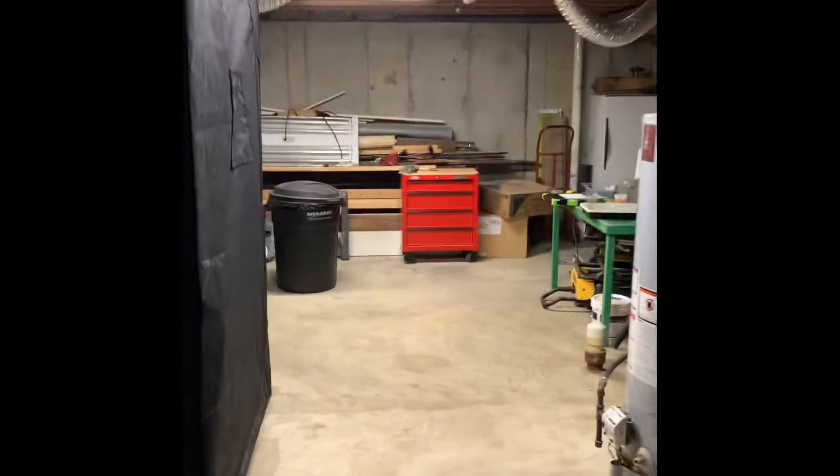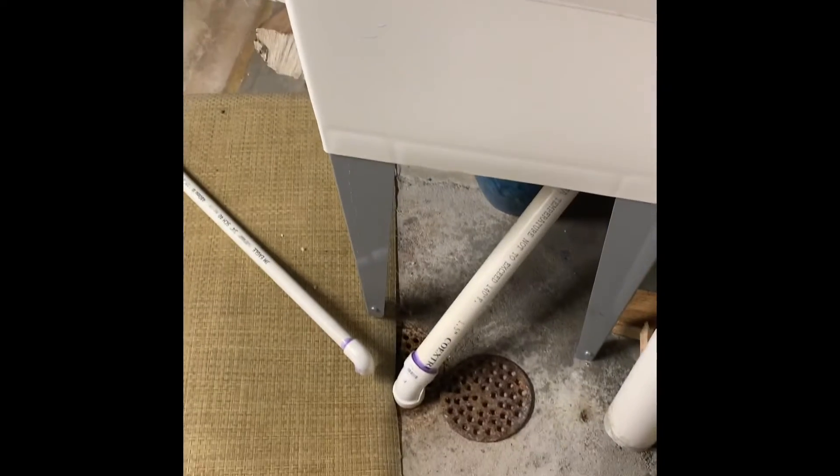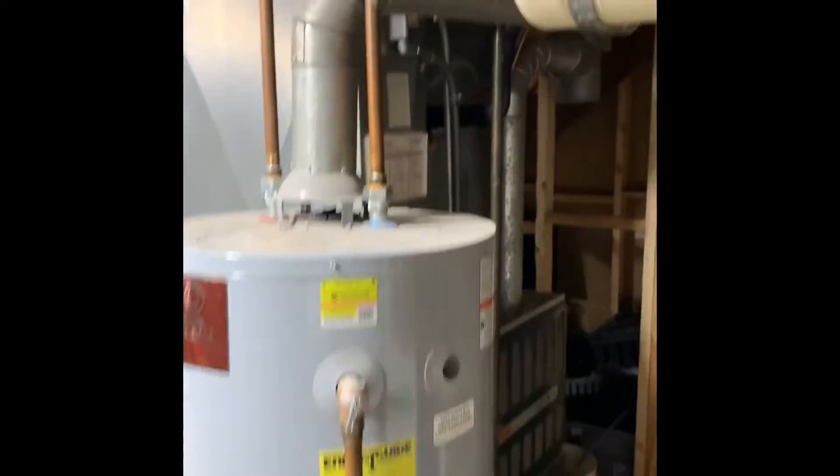In the mechanical closet here, our electrical panel is back on that wall — it's on a double-pole 30. First thing: the drain line is right here, about a 6-foot run over to the customer. Doesn't matter if we go back with vinyl or attach PVC.